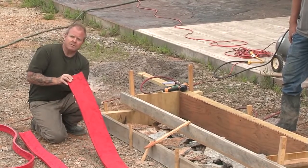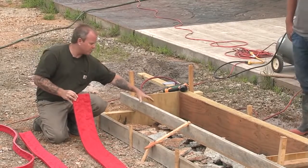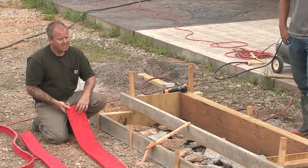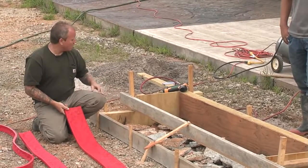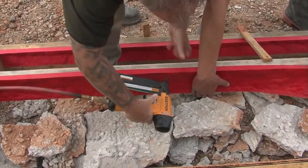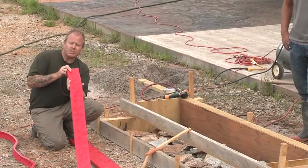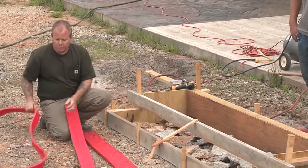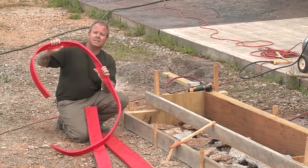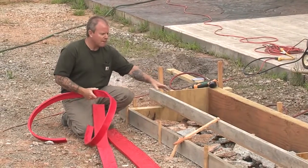It's pretty cool because it comes in a variety of different sizes. Here it's six inches wide, so it really retrofits nicely onto a standard 2x6. A couple ways that you can attach it — you can use finish nails, or I like to use a brad nail gun. It's real quick; you just shoot brad nails in and you're ready to go. It also comes down to 4 inch for a traditional 2x4, and you can even use the 2 inch ones for countertops.